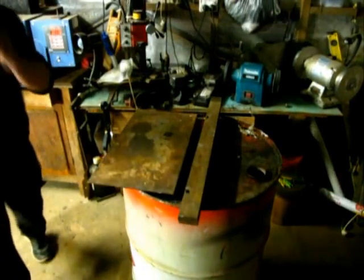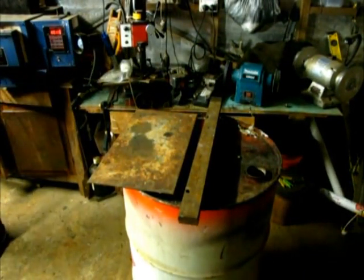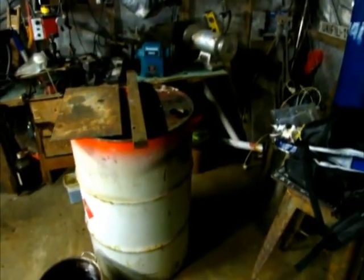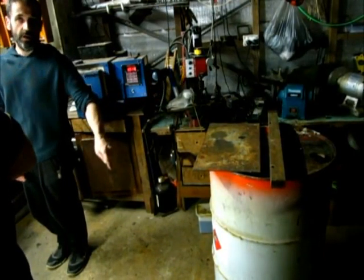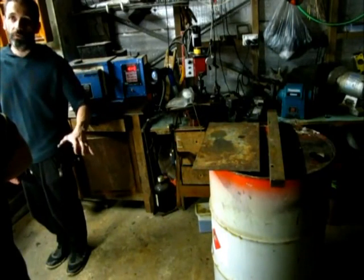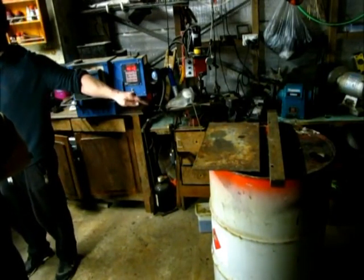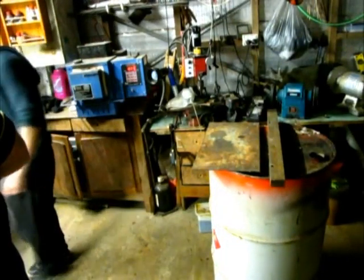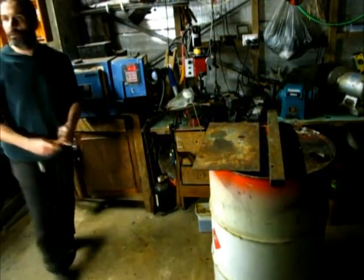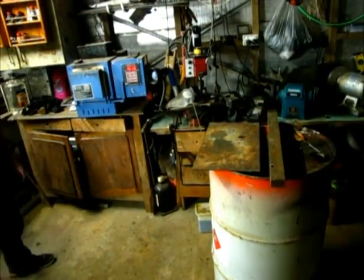Normally when you quench in oil, all of a sudden your workshop smells like a fish and chip shop. Not with this one, because that's a mineral oil. I've got canola oil. Canola oil is a slow quench, and this is a fast quench, but I don't really care, because when the blade goes into the oil, it's already been quenched. It's just to cool it down. It still has to reach room temperature within 2 minutes. So I leave it between the plates for a minute, and then by the time I take it out of the foil and dip it in oil, that's about 30 seconds. So I'm sure that at the end of the 2 minutes, the blade is at room temperature.